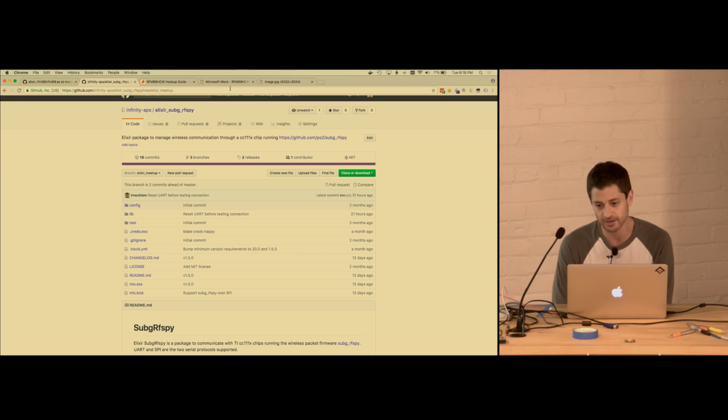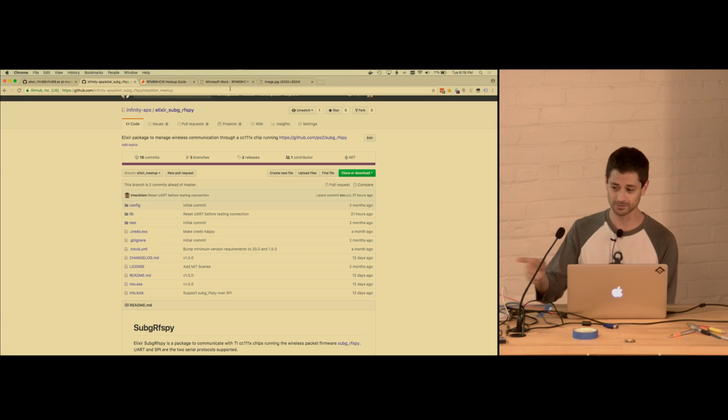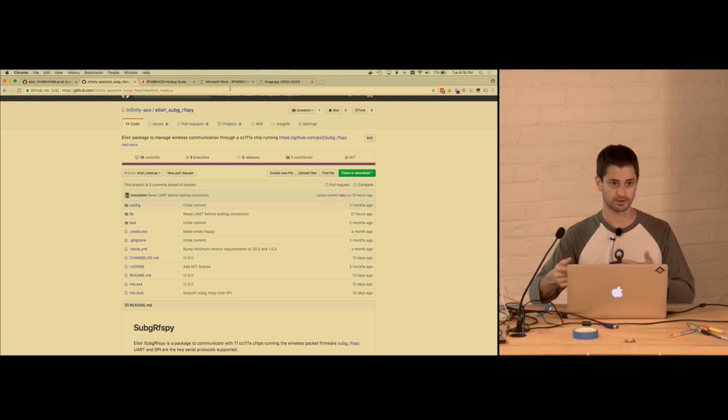Yeah, you could, so the packet radio kind of acts like the lower levels of TCP/IP, right? You could build ACKing and NACKing structures. In fact, the RFM chip by default, I'm going to override it with our configuration, but the RFM chip out of the box has retries. It has what's called data whitening. It does the 4x6 encoding where it takes a nibble and turns it into an even number of zeros and ones in 6 bits so that it's using constant transmit power, but it's also not holding ones or zeros high or low. It's not taking up the available time with all ones or all zeros and setting potential clock differences into play and things like that. So there's a lot of stuff built onto that chip that if you just used it out of the box, you'd get for free. I have to do it in software because of some specific things about what I'm doing.